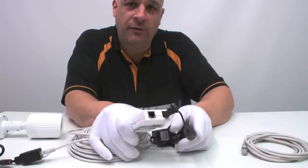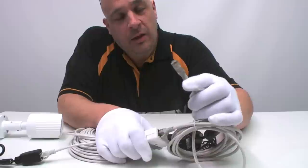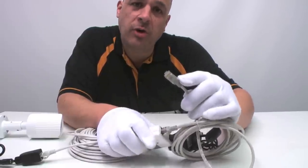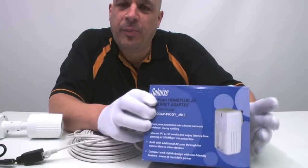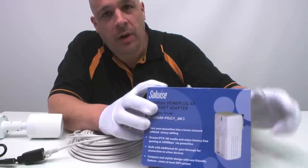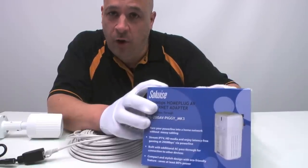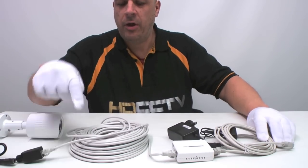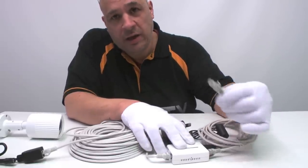There's one socket left on the injector, which connects via another cable to your network connection. This can go directly into your router or broadband box. If you want a wire-free system, you use a home plug — they come in pairs. You plug the cable into the bottom of one home plug, and have another near your router with a cable going into the router. So the camera plugs into the long lead, the long lead goes into the injector, the injector is powered up, and the network signal goes from the injector into the router.